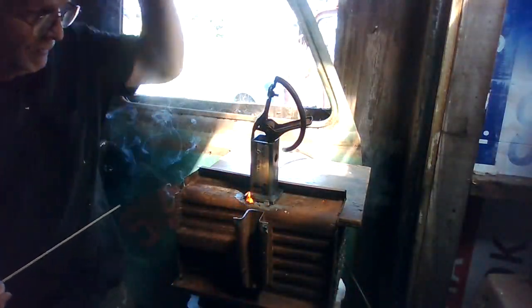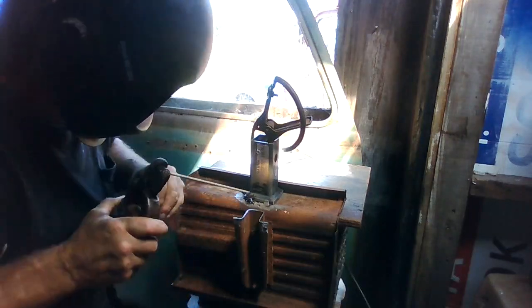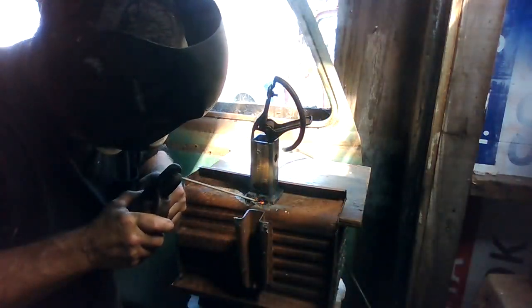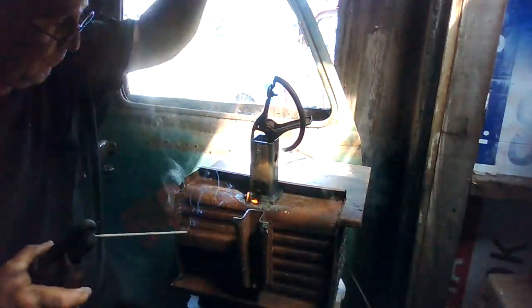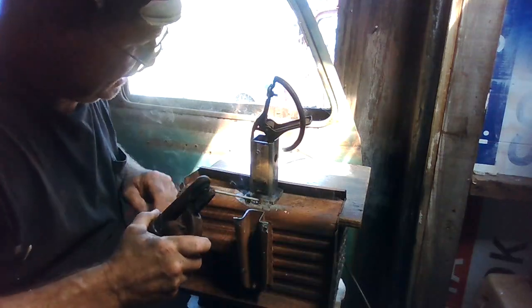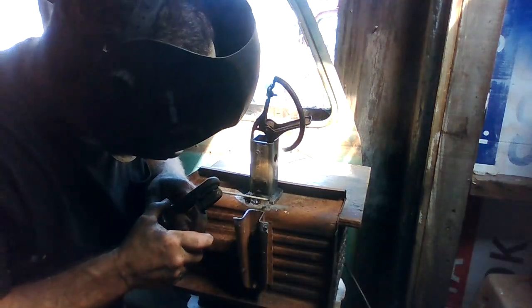I knew it — I'm trying to be so careful not to burn through and I got a little over-anxious, so I'll get back to what I was doing at first. I wanted to run some of the heavier metal down to the lighter metal because I'm going from a piece of 3/8 to a piece of 18 gauge.